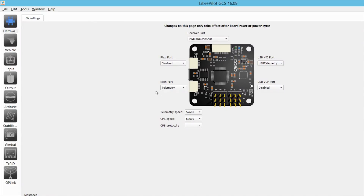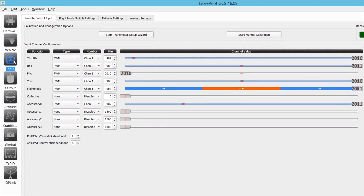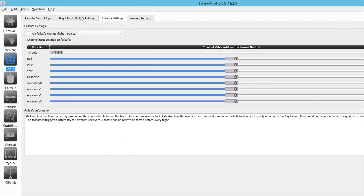Here is the setup for the flight controller — the vehicle configuration to make sure your channels are all set right. I've set all my channels and got everything going correctly; it even has you calibrate the radio to make sure your center points are right. I was able to set my switches with flight mode and arming on the same switches I use in Betaflight. Failsafe is set so it will drop out of the sky.